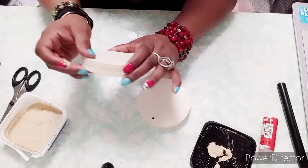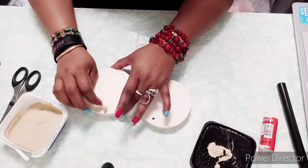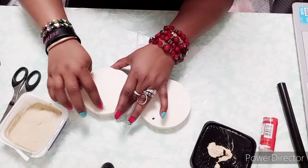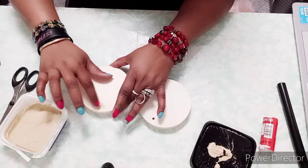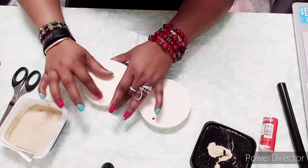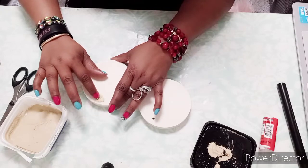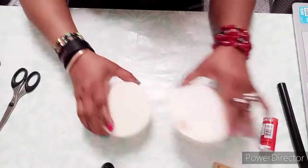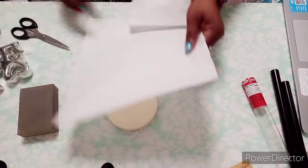So to fill the hole I'm going to start with some wood filler and I'm going to put it inside, seal up that little hole and then I'm going to sand it down. Then I want to make a silver set so I'm going to spray paint with a metallic silver paint. You see there I'm just taking my finger and just a little bit of that wood filler and trying to sink it as far into the hole as I possibly can get it so that I will have a smooth surface. It dried pretty quickly and the sanding took me very little time — maybe 30 seconds if that much.